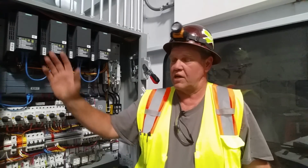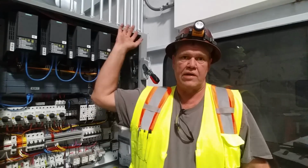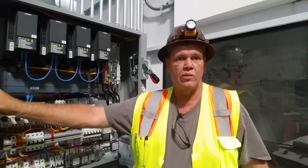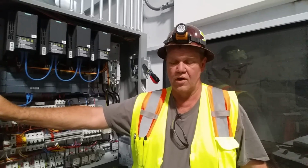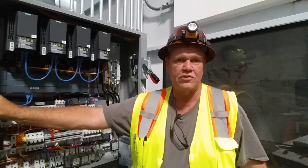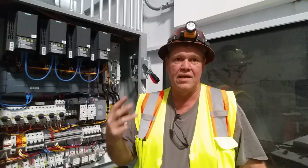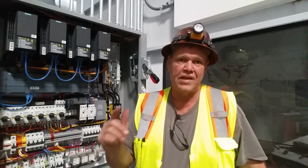It's about segregating your voltages, creating a separation within the panel that matches, because you spent all that time doing it with your pipes, why not do it in the cabinet too? And that's why we separate, and that's why we make looms. If someone goes just completely crazy inside of a panel, they just wasted far too much time putting that thing together. You need to be able to put a panel together quickly, make some money, and not get completely OCD with it, all right?